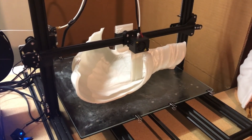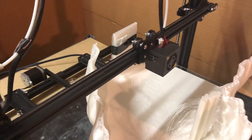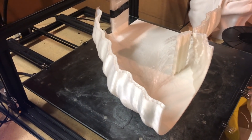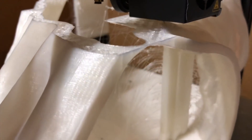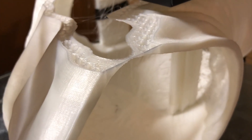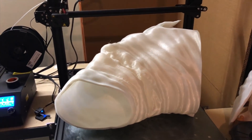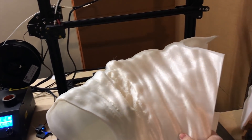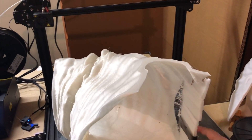In addition to those steps that I just outlined, I also, for the bottom layer, increased the number of perimeters that I was using, meaning that I made the walls thicker — twice as thick — and I also bumped up the infill a little bit just to make everything nice and strong so that it could support the layers that would be resting on top of it. Here I am printing the part of the tail. There's hardly any support material being used here at all. I just put it in the places where I thought it was absolutely necessary. After all, this is gonna be inside the print and you wouldn't be able to see if there was a slight blemish. So I just put it in two or three places, and it worked just fine. If I had tried auto supports with Simplify 3D or something like that, it would have probably filled up that entire tail section and just taken forever.